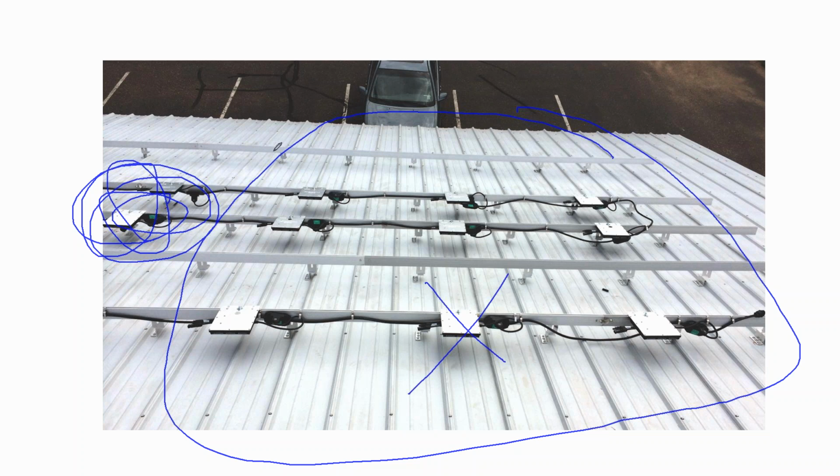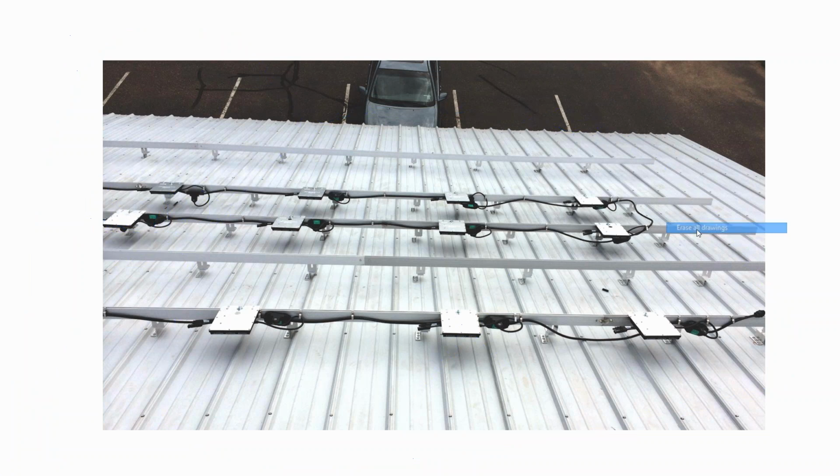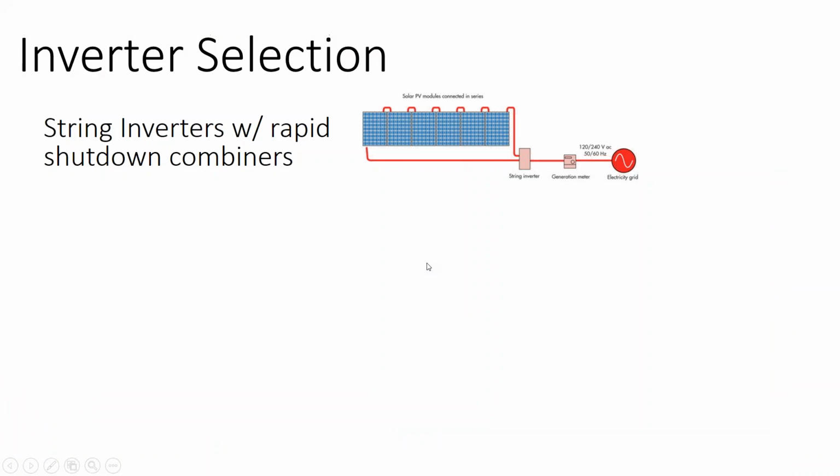There's a danger in the old-school approach of one inverter for the entire system: you're taking all your power cables and running them off the side of the rooftop. And if the power goes out, this cable remains energized. That can be a problem if the power goes out because your building's on fire and the firemen have pulled the plug to your power.